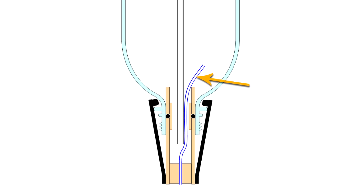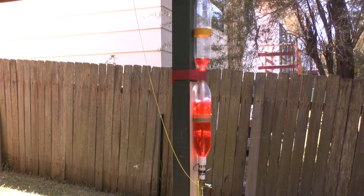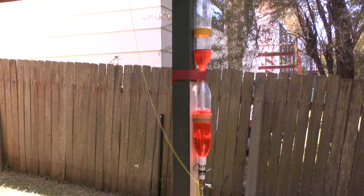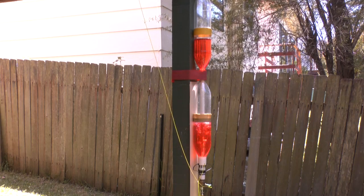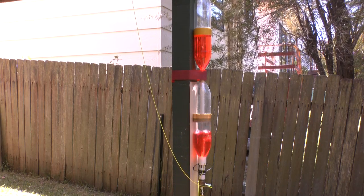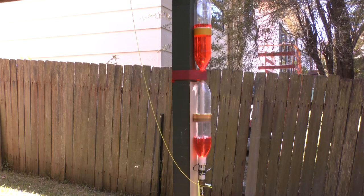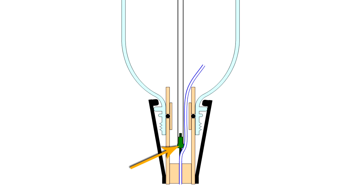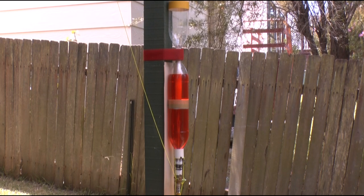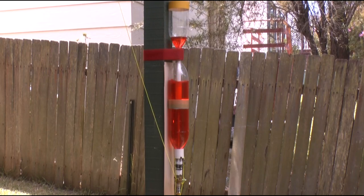So we added a thin tube to the release head to bypass the bottom of the extension tube. This worked well, but because the bottom of the extension tube offered less resistance than the non-return valve, more water was forced into the sustain chamber than was desired. With the last attempt, we partially blocked the extension tube in the release head, and only then the non-return valve behaved itself and correctly self-leveled the water and pressurised both chambers.